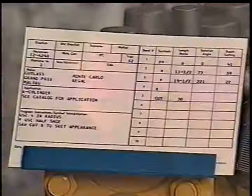What we'll do now is we'll get our tubing and we'll get our die switched. We already know we've got the right 4-inch radius die, a 2-inch diameter, because it says it's white, and it also has the numbers on top. So we know what the dies are. We'll change those now. We'll get the tubing in so we can get it measured and get it cut.